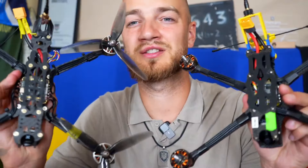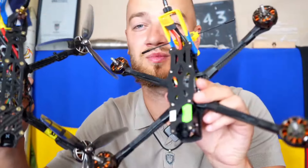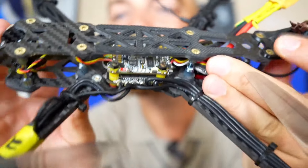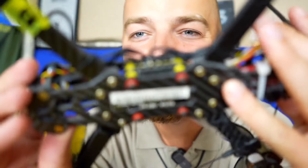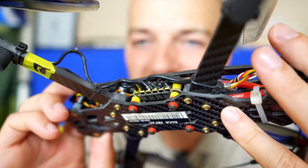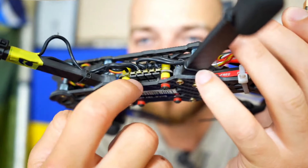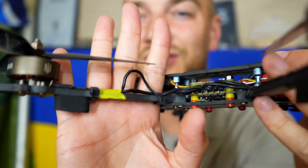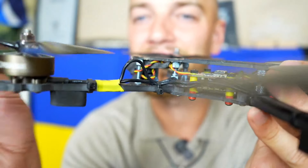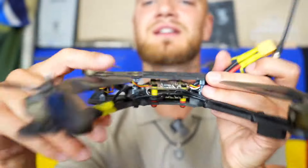Can you tell left or right which one's ours and which one is from another drone factory? What you'll see here — if I can get it to focus correctly — is the wiring of other drones on the front lines of Ukraine. As you can see, they do this very interesting wiring on the outside, going into the board from this direction rather than from the inside. The wire here is so long that this blade hits it, and that was actually what led this drone to fail.